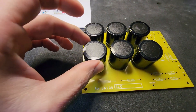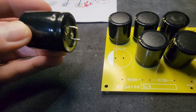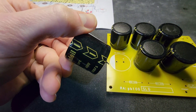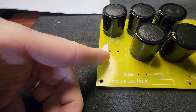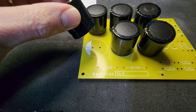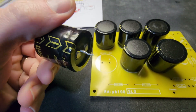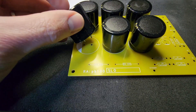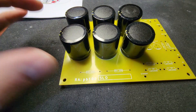I'm about to put these caps on. There's a stripe here which I assume is the negative lead, and there's a big element over here which I'd assume is the positive terminal. There's no plus sign on this, but it definitely has the sign of a negative, so I'm going to assume they all go the same way and are all oriented the same.